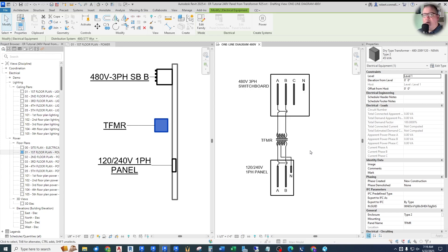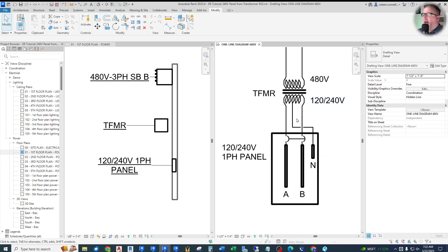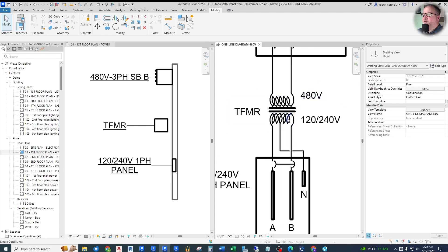Let me show you a wire-by-wire diagram of this kind of single-phase connection. If you look at the panel down here, we have a 120/240V single-phase panel. There's actually phase A and phase B inside the panel — these are bus bars that all the branch circuit breakers connect to. We have the main circuit breaker shown up top, phase A, phase B, and then the neutral. We have a three-wire system here, and it connects to one coil of a transformer. It's center-tapped to get the neutral, but line to line is 240V. Line to neutral is half of that — 120 and 120. This is just one single coil of secondary on a transformer.